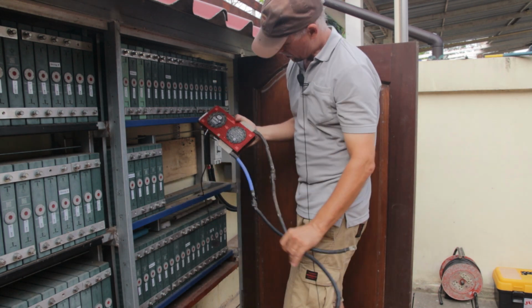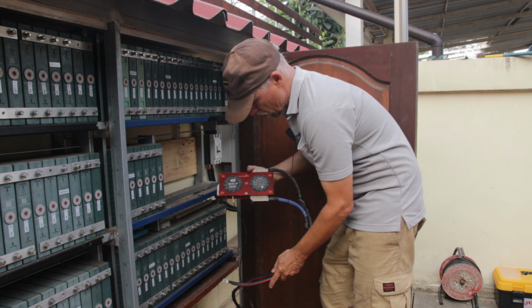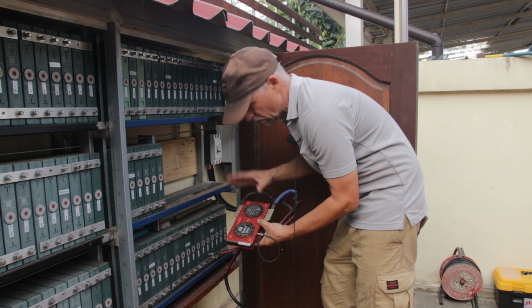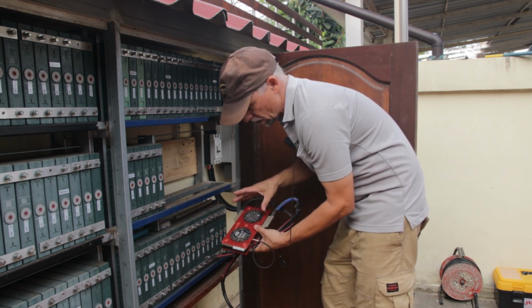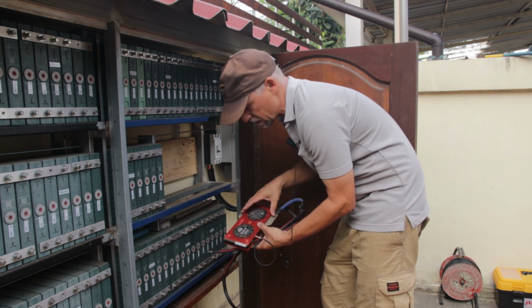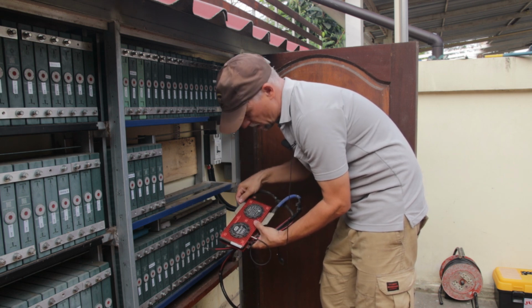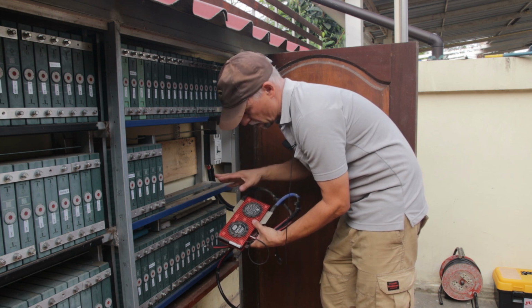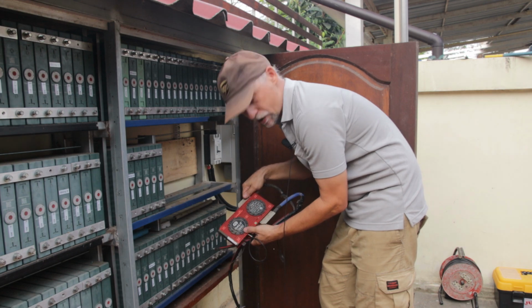Yeah, the BMS which I have used was a 200 amp BMS from Daly, and it did quite a good job. Normally I did not balance this pack. After I got the Deye inverter, I actually also set the BMS so that it could do its passive balancing job, and it did it quite well. Actually, in the last months now, the pack voltages have been quite held in check.